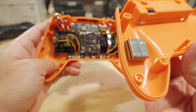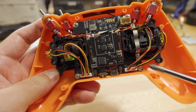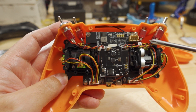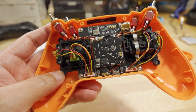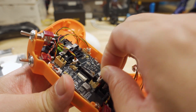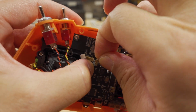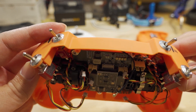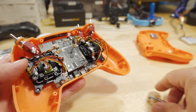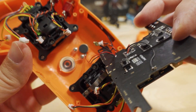I'm going to add a little bit of foam inside here because the radio sometimes makes a hollow sound, especially when you hit the gimbals hard. To get the board out, there are four screws — one here, one here, one here, and one here. Then you unplug all four switches on their little connectors, and all four connectors for the gimbals, and the board should just pop right out. Make sure you pop off the UFL antenna carefully and don't break the connector — it's just a small patch antenna here, and that's where you want to point the antenna at your drone.